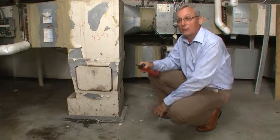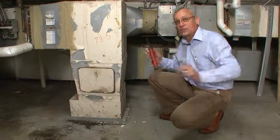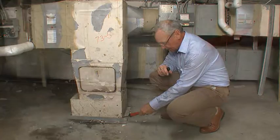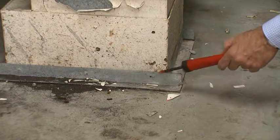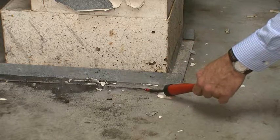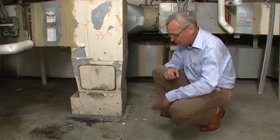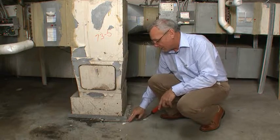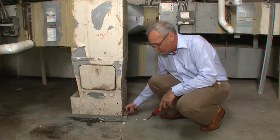We're in the mechanical room and we're making the floor part of our air barrier — everything above is treated as outside the conditioned space. Here we have a duct penetrating through with gaps and cracks around the sleeve. You can see a little bit of air movement at this point and underneath the sleeve as well. The taller the building, the greater the stack pressures. We're going to caulk the sleeve on the top and the bottom to create the air barrier, getting as close to the duct as possible and tying it into the air barrier.